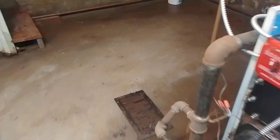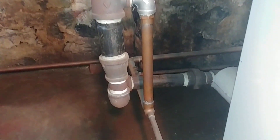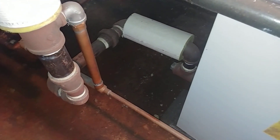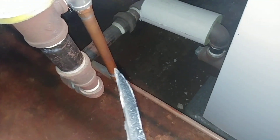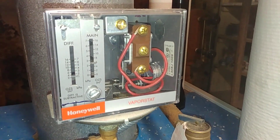This is probably one of the first ones I put in with a stainless steel connector to go from the copper. The water feed goes in here and into that T — which I would not do now. I try to avoid that because it tends to blow the water back. I usually like to put it in a T on the side 90 outlet rather than on the run.